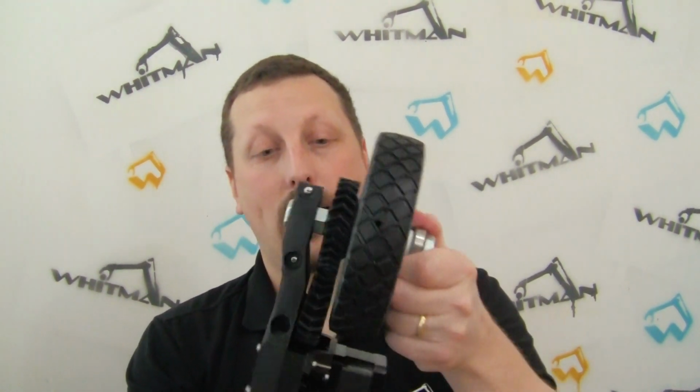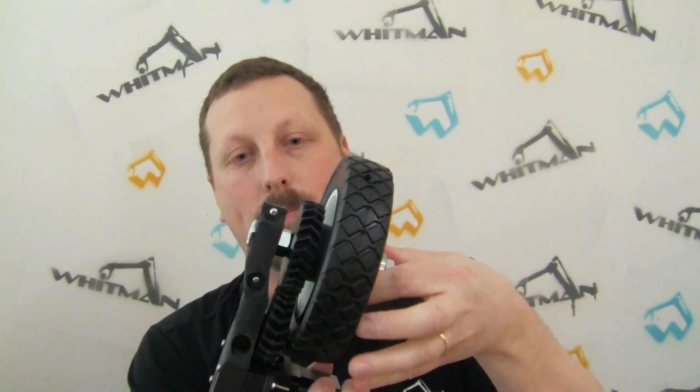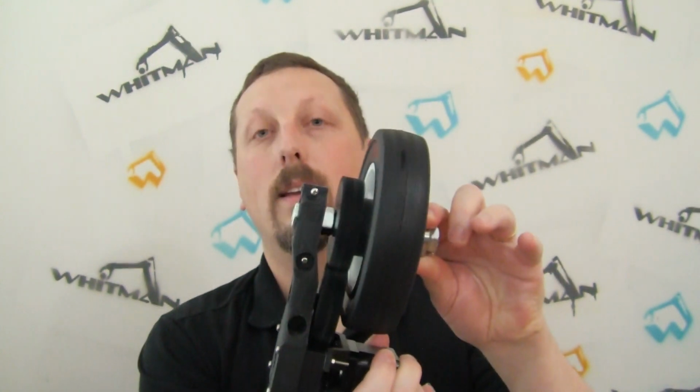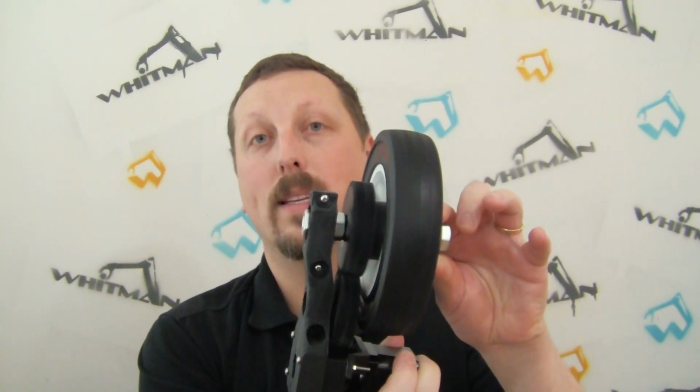Okay, so that's hilarious. It's extremely loud, but that's because I only gave myself 1/4 of a millimeter of extra space between the axle and the idle gear, and then 1/4 millimeter between the idle gear and the motor, and that's just too much pressure. If I pull these apart a little bit and we try it again, you can see it's a lot quieter. It's only because it's pressed together really tightly.